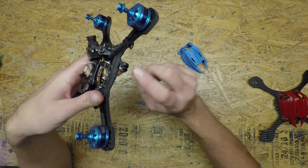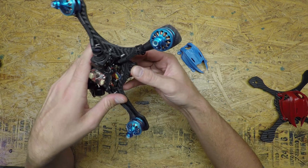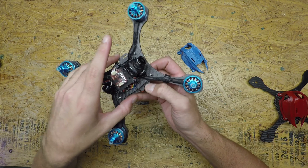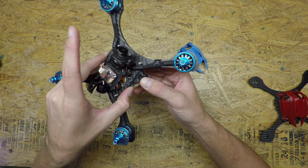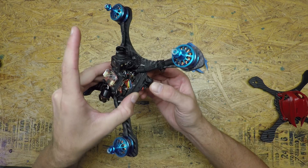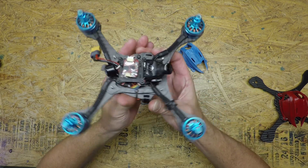The way I use the wing is to mount the capacitor in a remote location outside the stack, because when I'm getting in and out of the stack the wires move around a lot and end up stressing and breaking, requiring repairs. If it's remote mounted — somewhere that's not going to move when you're working on the stack — it's more likely to last a longer time.